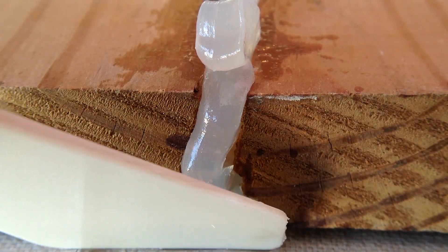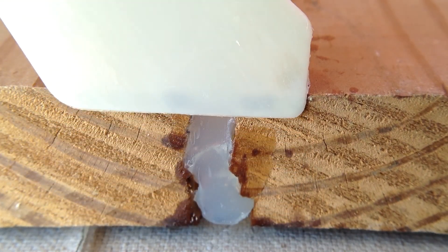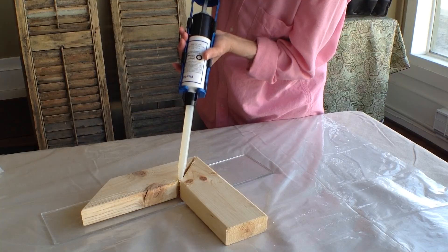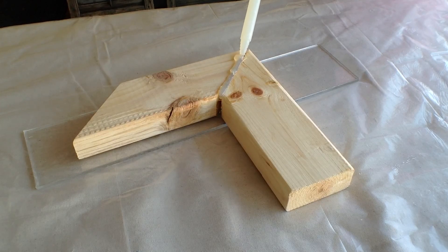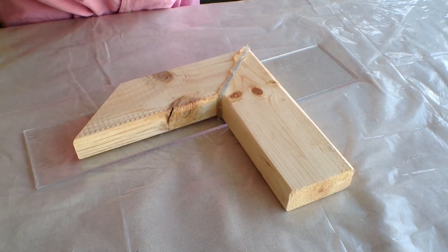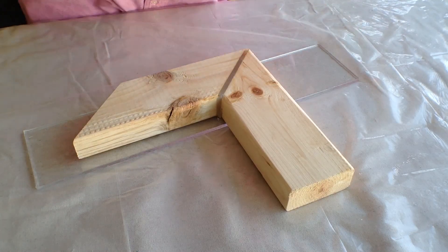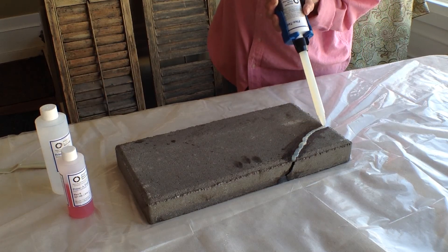Again, screed off the repair with the sculpting knife and your repair is complete. You may use the excess epoxy you just screed off to pack other parts of the repair or to touch up anything that may need it. The 315 BX gun makes joint repair quick and easy as well. Concrete and masonry cracks are also easy to repair with the 315 BX battery powered gun and mixing nozzle.